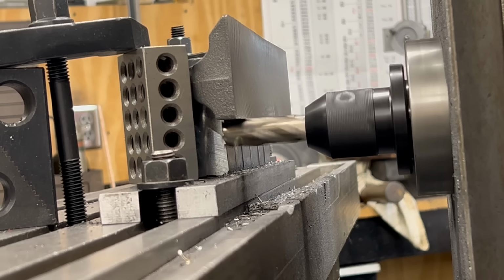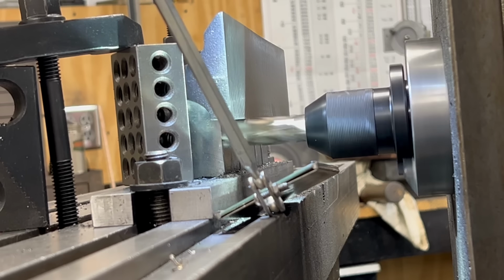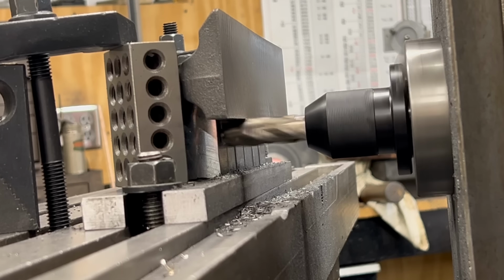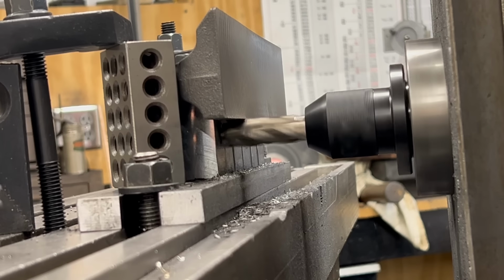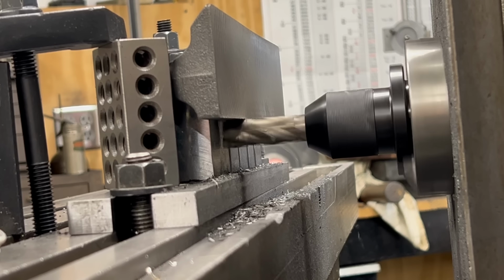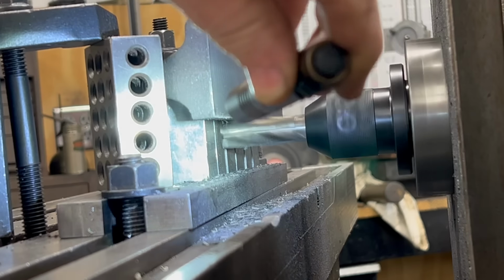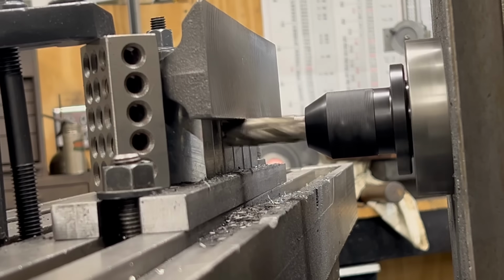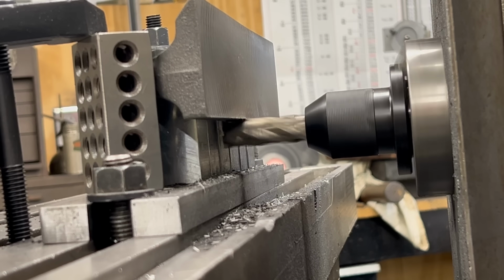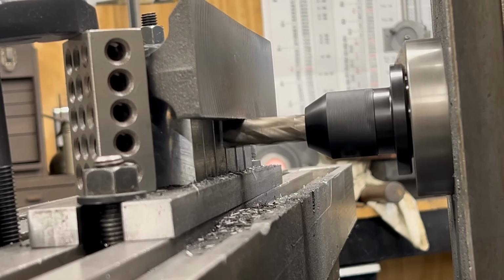Well, as they say, clearance is clearance. Looks like I'm going to have plenty of clearance for this end mill. I won't be machining into the aluminum step blocks at all. But I just need to use a mirror and a flashlight to see how well this is turning out. I want to make sure I machine enough of the back away to clear out that occlusion I noticed and showed in the first video. If I don't get it all, that's okay. I should be able to get the majority of it. Hopefully there will be no others that will show up in the casting.